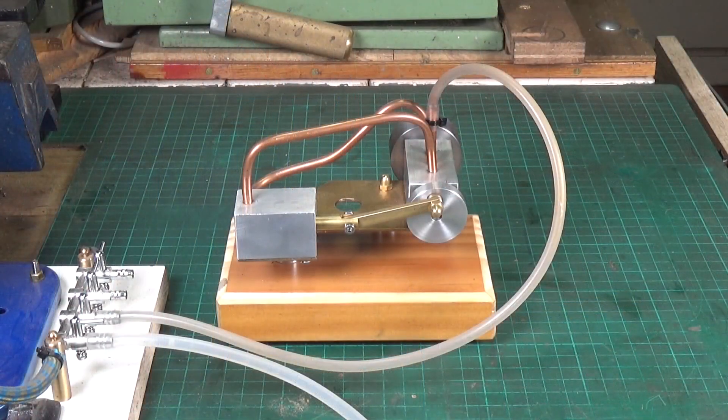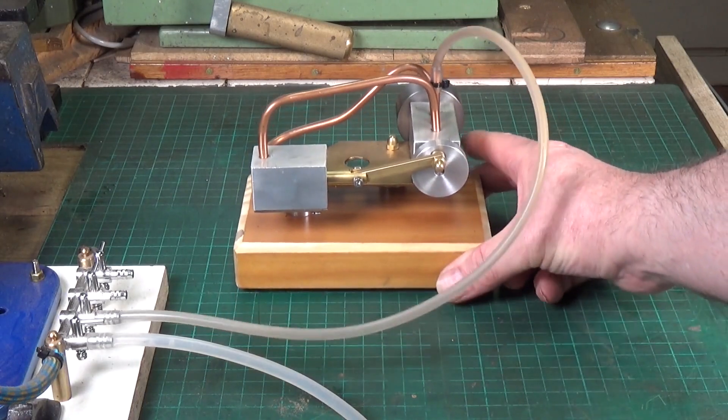I'm going to think about this little rotary valve engine. I'm not happy about putting steam through it, particularly when you've got a steel shaft in an aluminium block — you mix steam with that and that's not a good recipe. I'm intrigued enough by this that I think it would make a great steam engine, it really would.